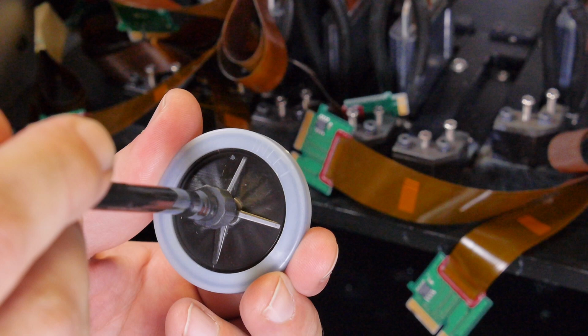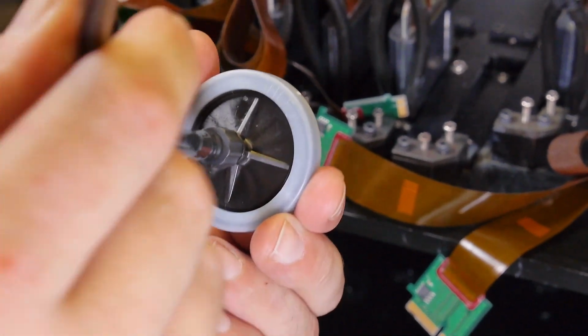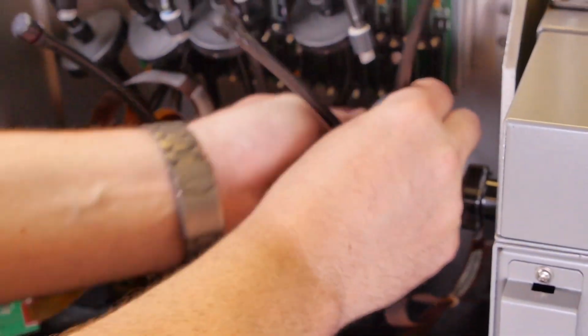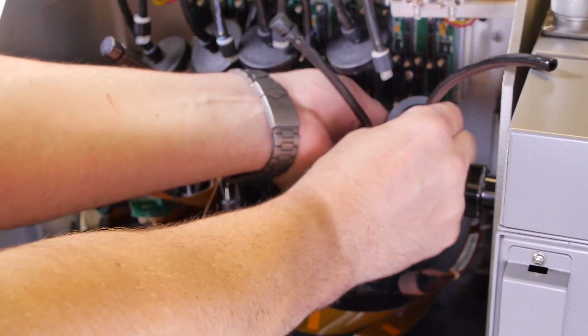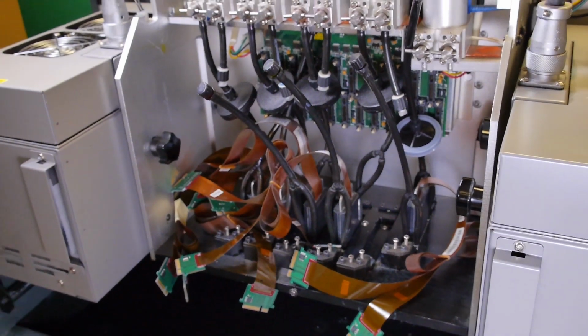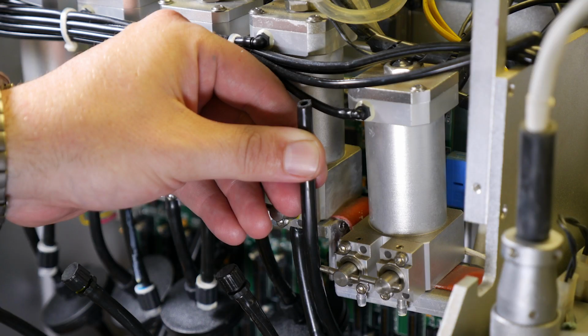Now you are ready to screw on the secondary filter. Verify the inlet label is facing our ink supply direction, in this case facing up. Continue the ink supply tubing with another filter attachment fitting and tubing that will run up to the subtank. Leave the tubing long for trimming to length at a later step.